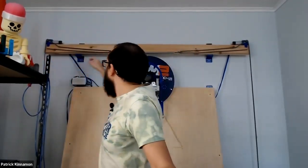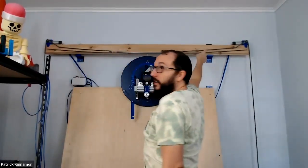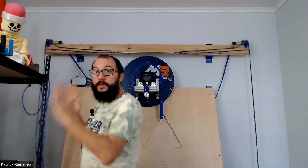Well, you want your motor offset to be what your actual frame is. So when you're typing it in, I would suggest doing it multiple times and seeing exactly that distance, and it's hard to get that distance. So instead of trying to measure and guess where the chain is, if the chain was stretched straight across, that is that offset. So if you wanted to measure from the top of the motor down to your wasteboard, you can put a straight edge ruler there and measure from that, and that would be the correct offset distance that you want to try to get. So it's not from the top of your top beam, it's from where the chain would be if it was stretched across the top. That's the distance that you want. So probably from that side would be a great way to go and a great way to get it.